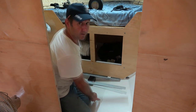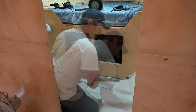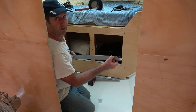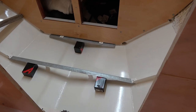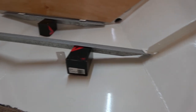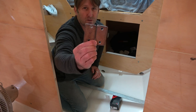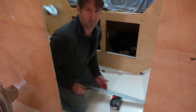This one needs little feet brackets to support it, but I should be able to see if it's going to fit. It doesn't quite - that 45 degree cut was actually good, it's just the depth, so I just need to take off a piece on the corner like that and that will be sweet. I've got that angle fitting nicely and also I've made up those brackets which will bolt between the cleats on the hull up to this angle.